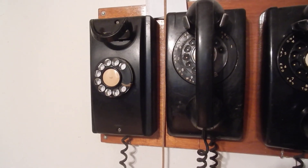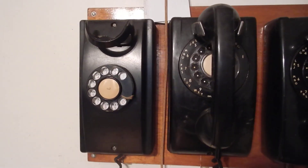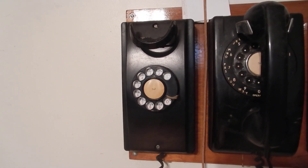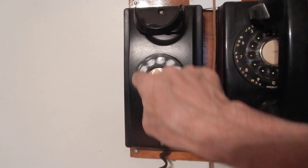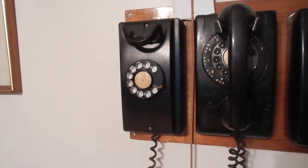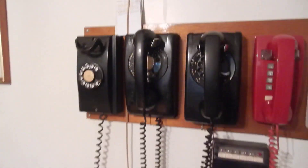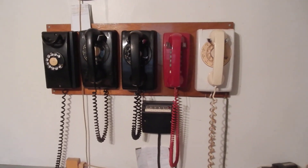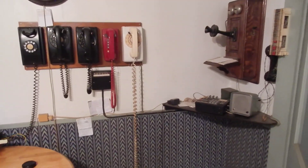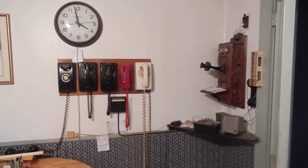Dial test fail. Dial test fail. Dial speed fail — 11.5 pps. Dial ratio pass — 63%. So we've got to slow it down a little bit. Dial test fail. Dial speed is 8.9 pps. Dial ratio is 63%. Please select test — line test, dial 2. Coin collect test, dial...